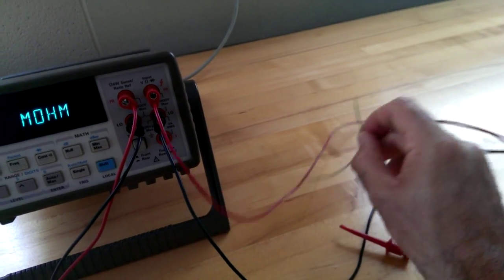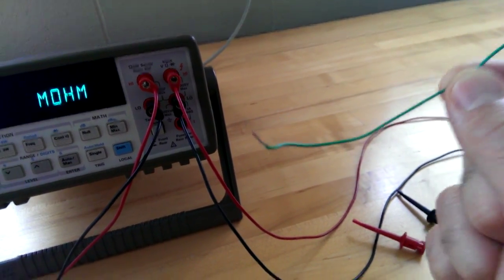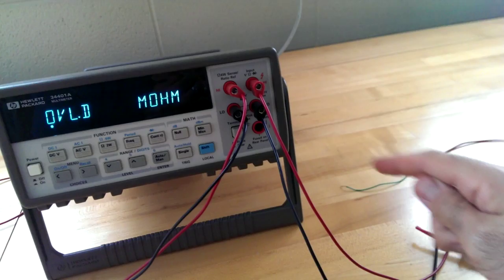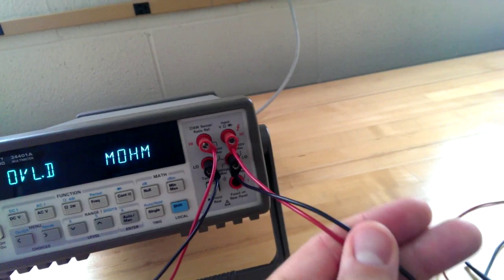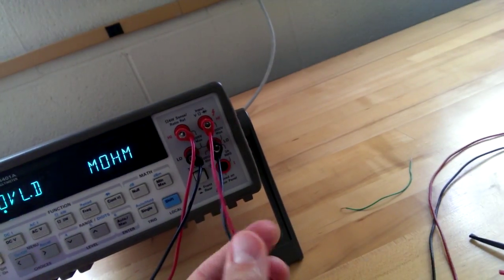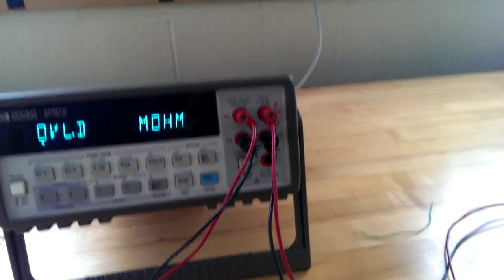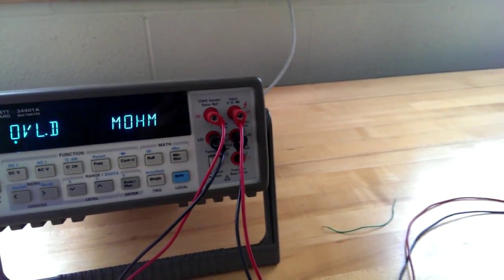And normally that's not a big deal as long as the resistance of the resistor that you're measuring has a resistance much greater than that of the leads. That way, if you get the voltage drop across the leads and the resistor, well, it adds up such that the resistance of the leads is negligible in comparison to that of the resistor. So let's say, for example, these wires are 0.05 ohms each, but your resistor is 1 mega ohm. Well, as you can tell by the simple math, 1 mega ohm is millions of times greater than the resistance of the leads.